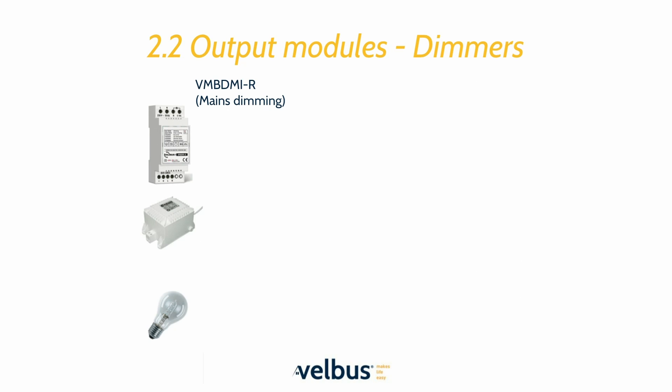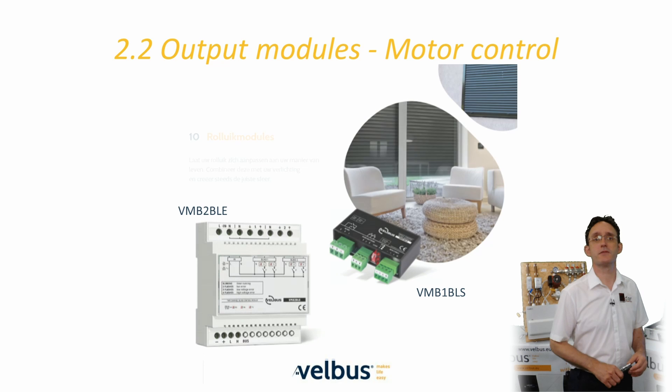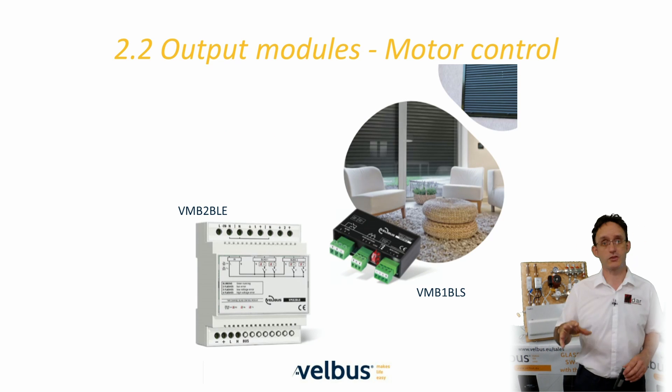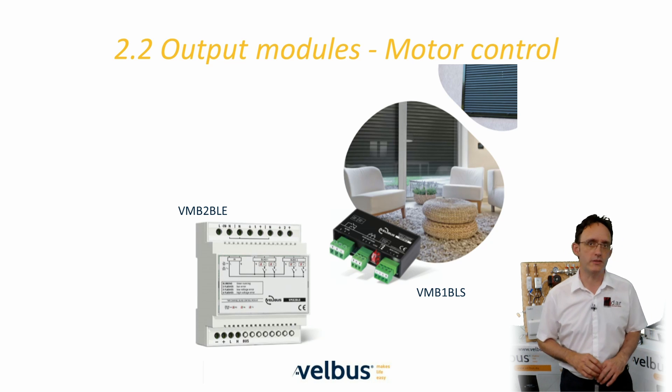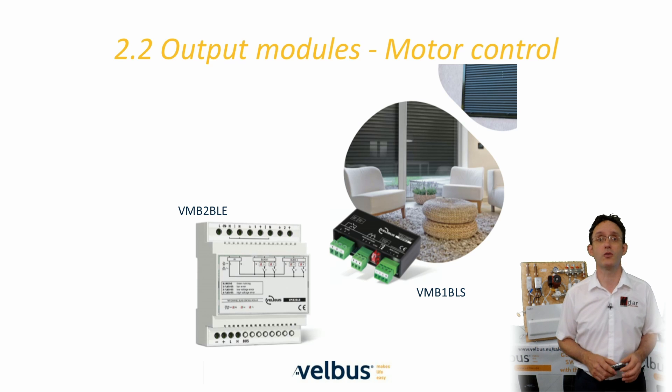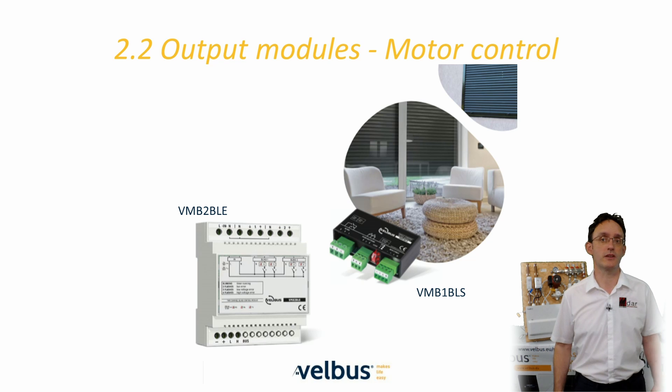The single channel Velvus 400-watt leading edge dimmer can handle inductive or resistive loads for use with a variety of dimmable devices. The four channel 0 to 10 volt universal control module can be paired with a wide selection of slave dimmers for mains or ELV control. The Velvus motor control modules use the common neutral and two live method, but can be adapted for DC inverting control for 24 volt motors, assuming those motors have their own limit switches, such as the Somfy 40 motor. Positional control is done by correctly setting the built-in runtime timers. The small universal module also has support for two button inputs to give your customer local control of the motor — for example, splicing the unit in line with a standard rocker switch.